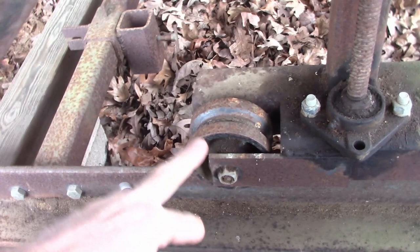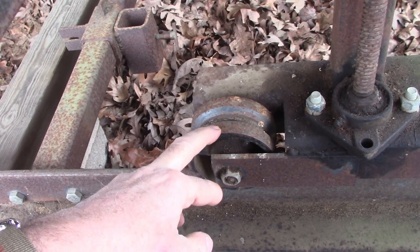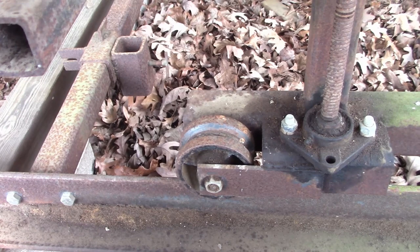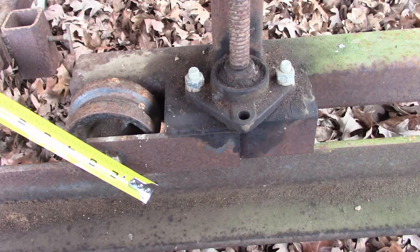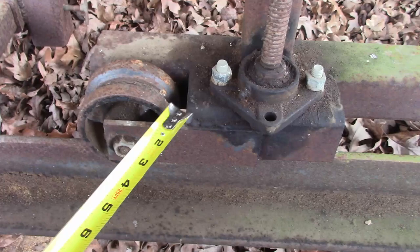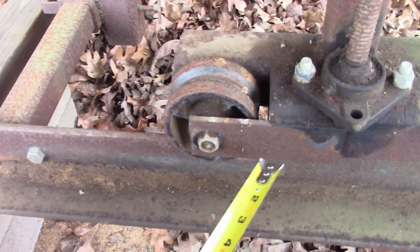These are the wheels the mill rides on — they've got a bearing on the inside. They're steel or cast iron with a V-groove. They appear to be four inches in diameter. I took two-and-a-half-inch square tubing and added a little piece with the wheel in there and a straight bar to hold it. It's got a zerk fitting right there and that's how you grease that wheel. I won't be able to give you part numbers — I built this years ago — but I'll look for any emails or order info and put it in the description.